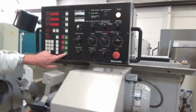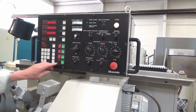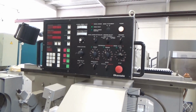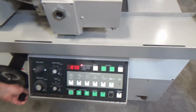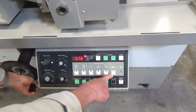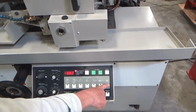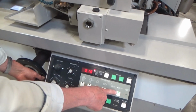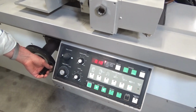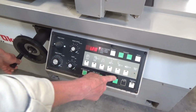First we'll bring up the hydraulics. Be good if we turned off E-stop. Yeah, let's get out of the E-stop and we'll bring up oil. We're good, scoop goes down. If you come down here, I can manually go through it. And this is really it, the way you set this up, which is really nice: we're at the home position now, or we can go to right end position, which is all the way back. But if I come manually and walk it through, I just turn that light on. That's like my starting position. And then if I wanted to get a little bit farther, I can make that my starting position.